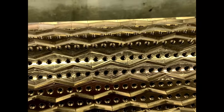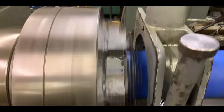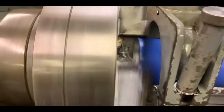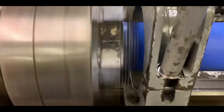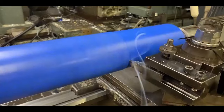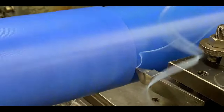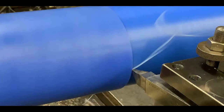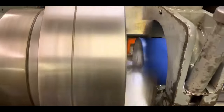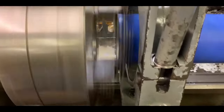His second question was: why do I have the steady rest so close to the chuck? To answer that, I need to turn the whole diameter as you see in the video. I can only cut about three quarters of the length. Once I finish, I'll slide the steady rest to the tailstock to support the end, and then I'll be able to drill a hole, which I'll show in the next set of videos. That's why the steady rest is at the front — I just slide it over when I finish turning the diameter.